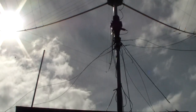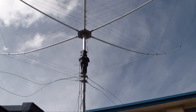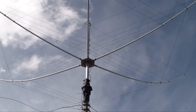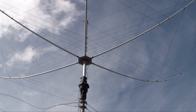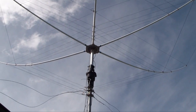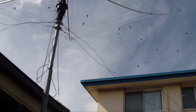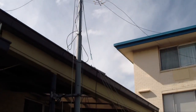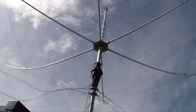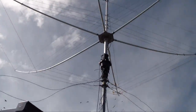The reason I'm out here at the moment is I'm looking to get this hex beam - I've just dropped it down so it's only about four metres above the roof - because I'm looking at just tidying it up, going through all the contacts and giving it a clean. I'm actually going to extend it to the top of the mast, which is probably going to put it up about 30-35 feet. I've got a friend coming over to help with the guy wires, and I've also noticed the feed line part is just holding on by a thread, so I'm going to tidy up those connections. I'll put some air chokes on because I'm getting interference coming through the TV off the dual bander, then put it back up and we'll be good to go.